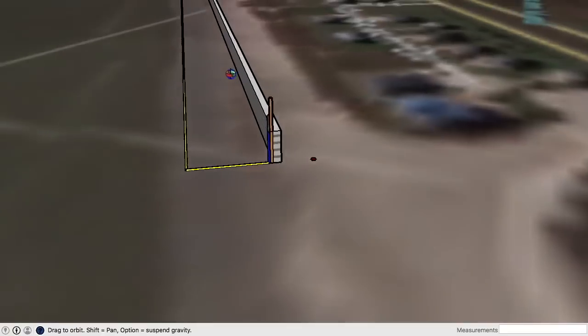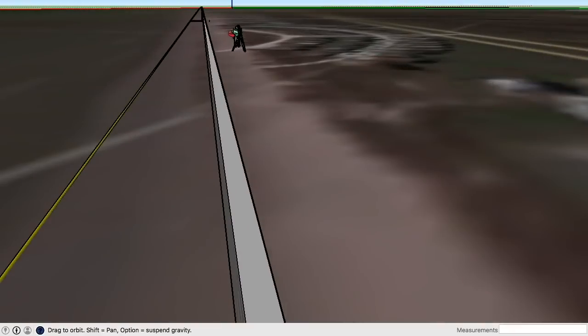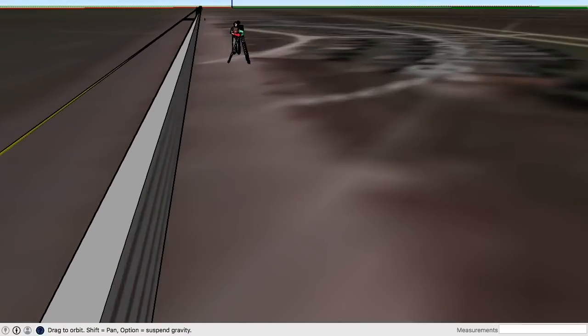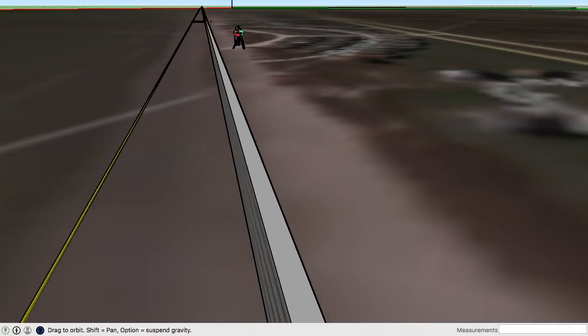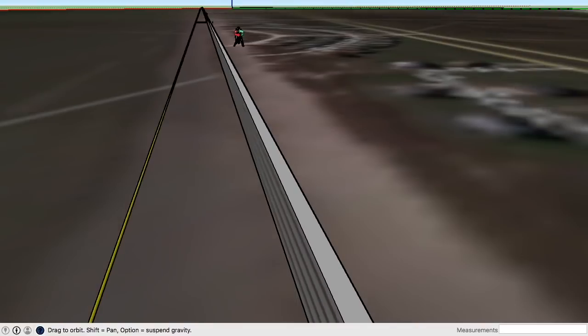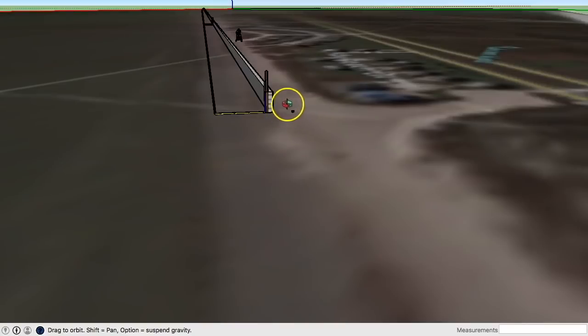Now you can see here, I've got a surveyor here. We are going to need to have a surveyor not using GPS equipment, but optical equipment with high tolerances, auto leveling theodolites or transits. And what they're going to need to do is set reference points down this beach in whatever distances that they can work within high level tolerances.